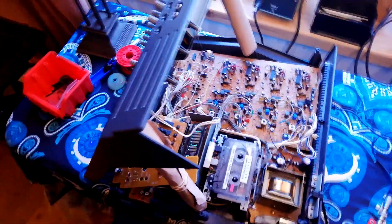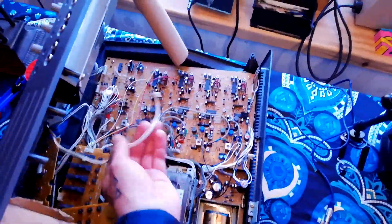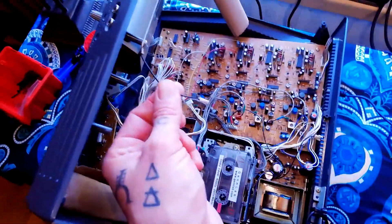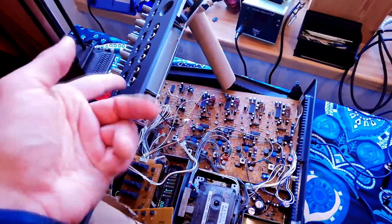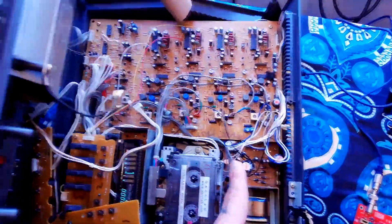The way to do this is to have the front of the unit tipped up. You can see I've disconnected the cable that would go into the power board here from the mixer, and there's an earth connection here. If this mixer was receiving power you would hear quite a lot of buzz in your headphone output, but for the purposes of calibration it doesn't make any difference.